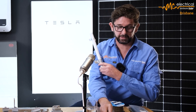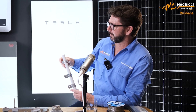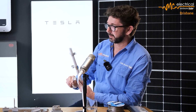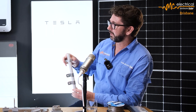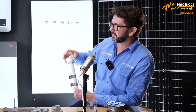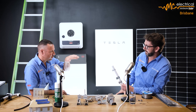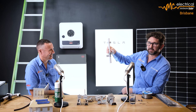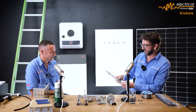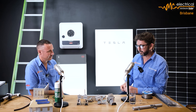Similarly, this is a zinc saddle — fine indoors, but as soon as you're running conduit up outside or using saddles on the roof, you need to go to a galvanised saddle. We use some indoors and some outdoors depending on location. Sometimes you also need a double saddle to get proper grip when you can't get that tension and need to really secure the cable back to the wall. Getting the right saddle in the right material for the right place is really important — we're tradesmen.